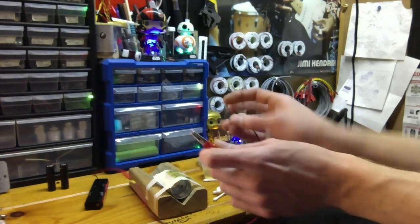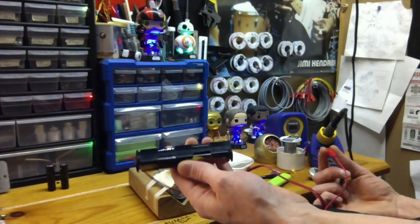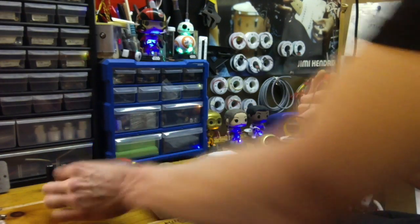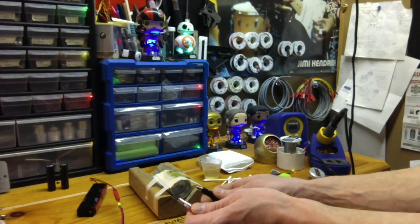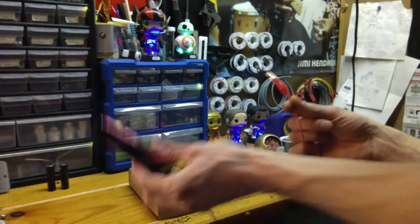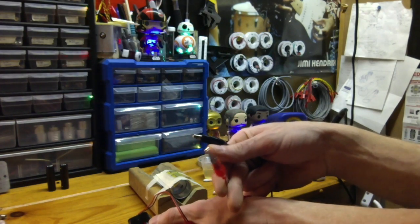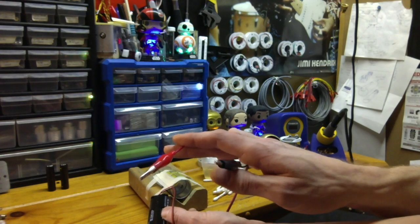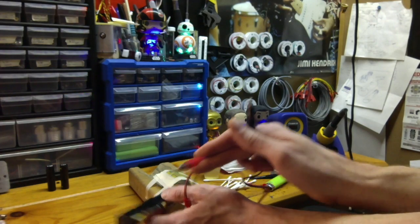Okay, so all you really need other than your power source. I got a 4 battery holder. I got 14500s in there. Just saber batteries. That's perfect for this. It gives you a strong etch. All you need is any 2 pieces of wire. Just hook up the wire to your battery so you've got yourself a positive and a negative lead. I like the alligator clips, just because they're super handy. You can clip them right onto these parts, which you'll see. And it works really well.